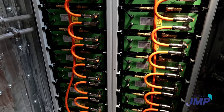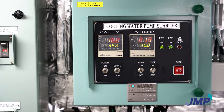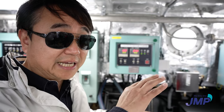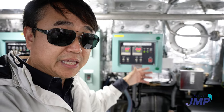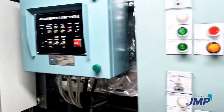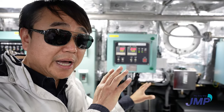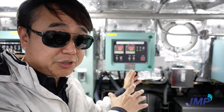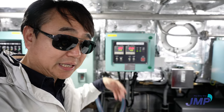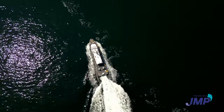This is a cooling package — cooling water pump starters. You can see the temperature and that remote on and off. This system automatically switches between diesel mode and electric mode. The battery needs cooling, the electric motor needs cooling, and the inverter converter needs cooling. When the system switches from diesel to electric, this pump automatically starts. And when it switches back to diesel mode, this system is switched off.